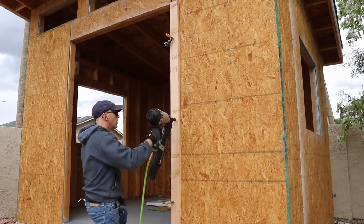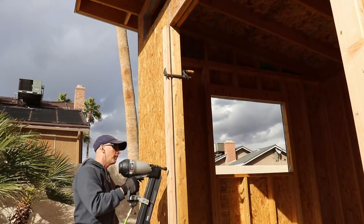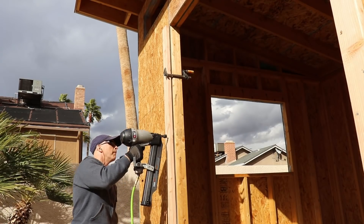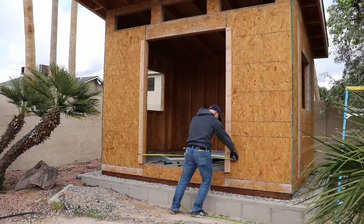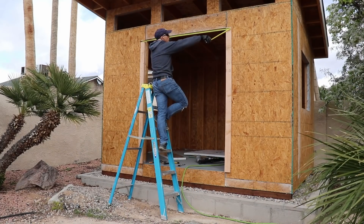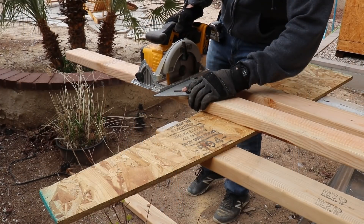As a side note, I plan on doing a stucco exterior. We get so little rain here in Las Vegas that I can get away with just doing the two layers of tar paper that act as a weather-resistant barrier used for stucco. This is fine for my area, but if you get more rain than a desert, you might want to install some house wrap under your exterior foam insulation. You want to do that before bumping out the doors and windows.